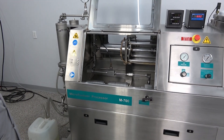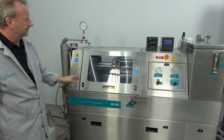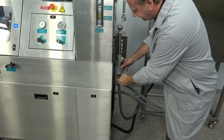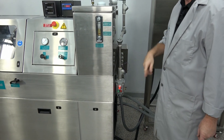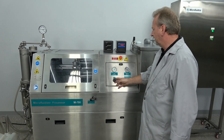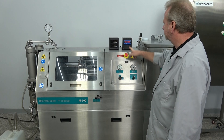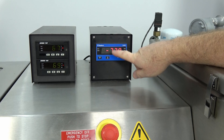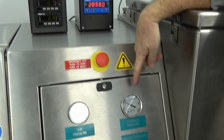Very nice condition. We're going to turn this on — so we'll power it up on this explosion proof switch. First, turning the power on over here. Now the motor is starting up — you can hear it running, but we still need to push the air actuator to get the hydraulics running. Simply pushing the button, and instantly you can see we're running at 2,000 PSI hydraulic, so we're running at 20,000 PSI on our product. The hydraulics is about 10X.